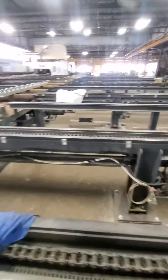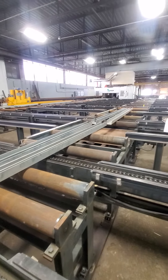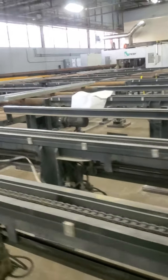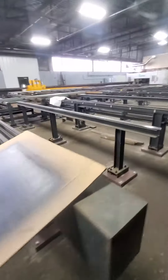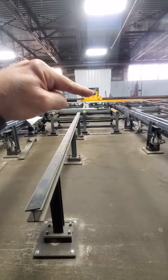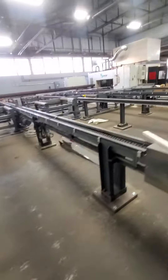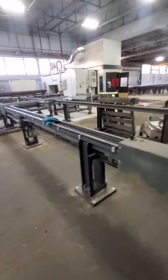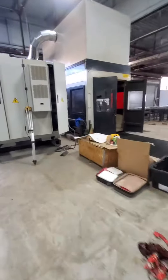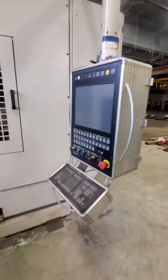Here we decide whether to unload or to load on that line. That's the line for the drill and the robot, and the coping robot — also called the plasma robot. This line goes down like that. There is another carriage with the pusher for the other beams going on that line. Here is the drill unit and the plasma unit, controlled from here. There's still a chip evacuator we have to put in.